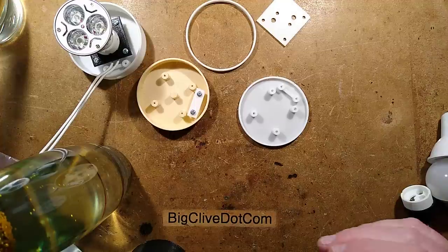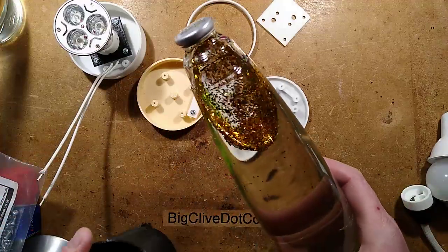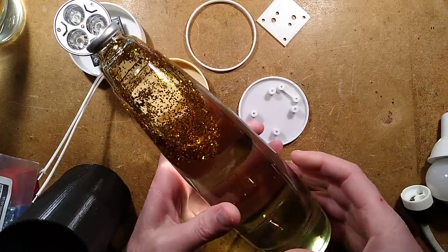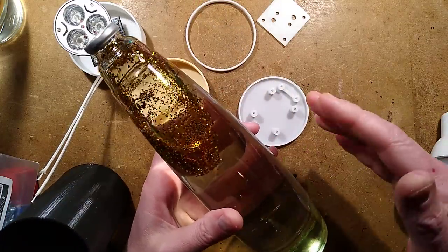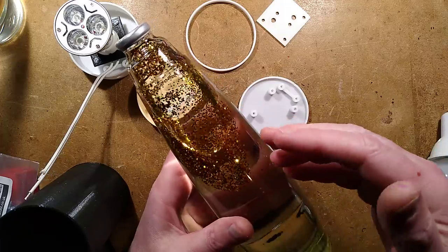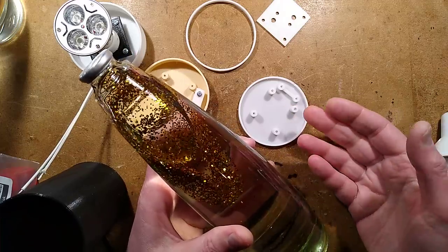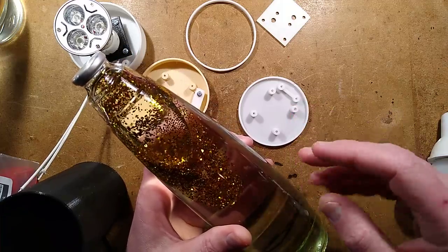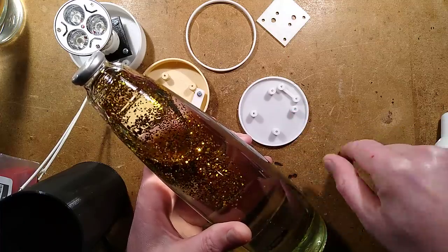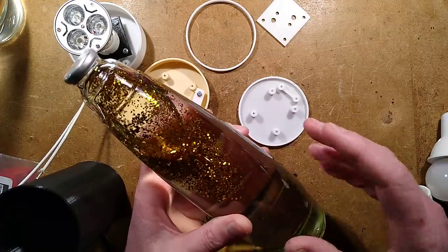Back at the bench, and let's explore the quite complicated world of glitter lamps. Because you'd think that a glitter lamp is very simple, it's glitter floating in water, and it's going to be so easy to do, but in reality, plastic of the optical quality required for glitter is actually very heavy. You tend to think of plastic bottles being lighter than water because you see them floating in the sea. In reality, the ones you're seeing floating have air pockets in them. The rest of the plastic is at the bottom of the ocean, unfortunately, even in that high density salty water.